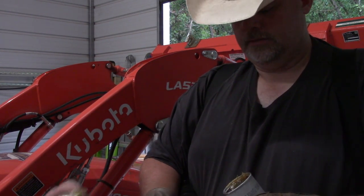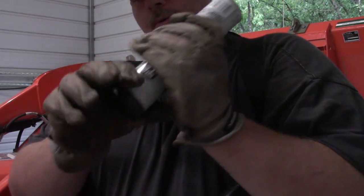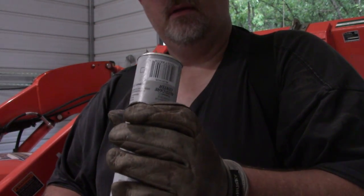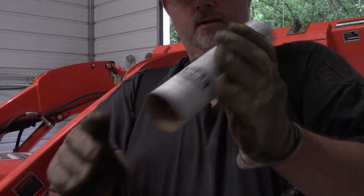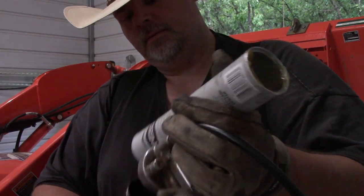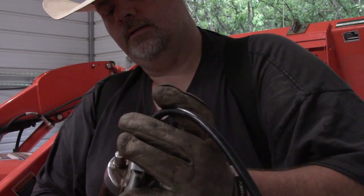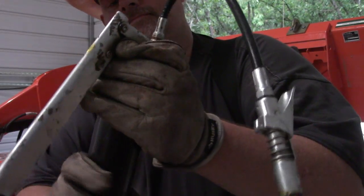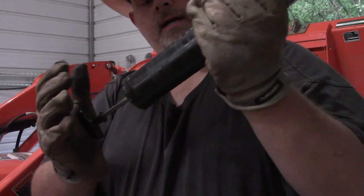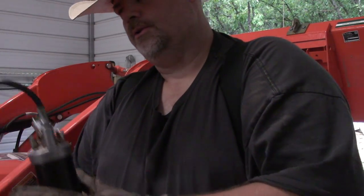Here, go put that in the trash can. After you pop the top of the grease can, pull this bottom piece off also. This bottom piece, there's nothing in there. So, you open up your grease gun, set that in there. Close this back up. Put the plunger back. There you go. That's spring loaded. There's a plunger in there that's spring loaded that pushes the grease up.